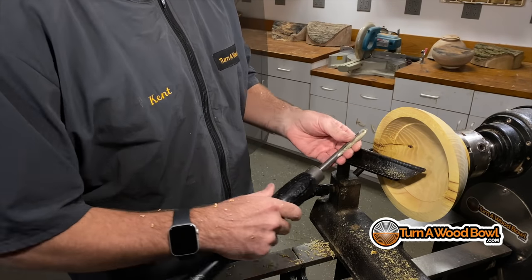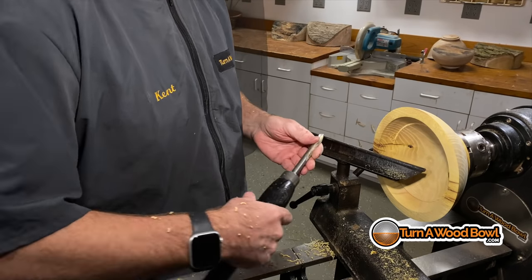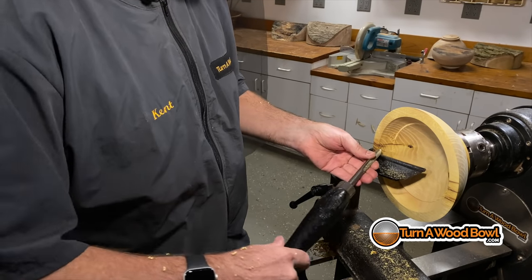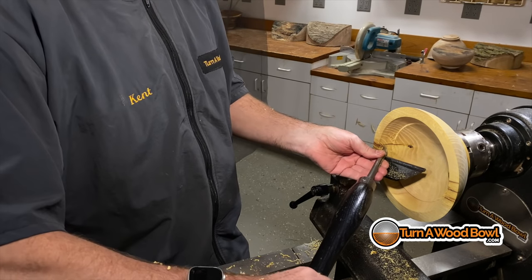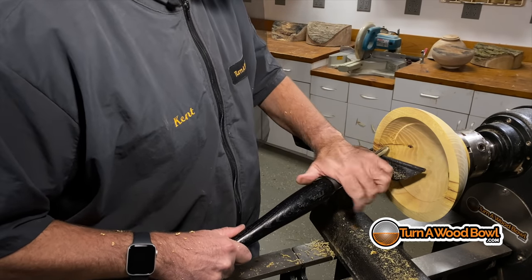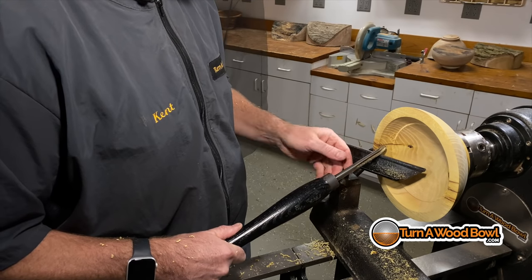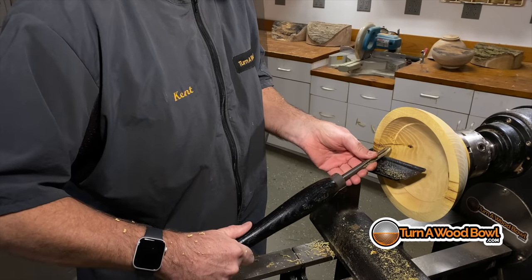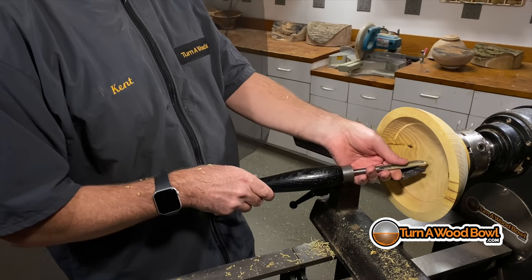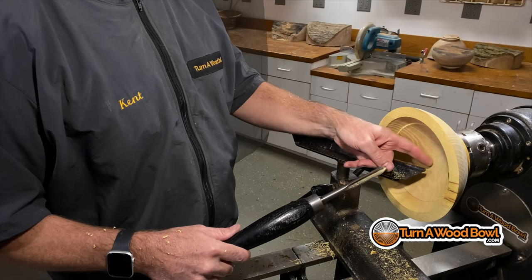The second common mistake is to have too much motion in your hands and arms while you're making this turn. Because we have to move the bowl gouge pretty dramatically, we can't really keep it rested up against our body and anchored like we do on the exterior of the bowl. Instead, we have to rotate it. Think of your right hand as kind of like a rudder — you're going to be moving the handle around like a rudder on a boat. But you want to make as much stability as possible with your left hand, going over the top and forcing pressure down to keep the bowl gouge in place, pivoting on one location as you gradually bring the bowl gouge around. And that's what will lead to a lot of tool marks and scratches and grooves on the inside of your bowl if not done correctly.